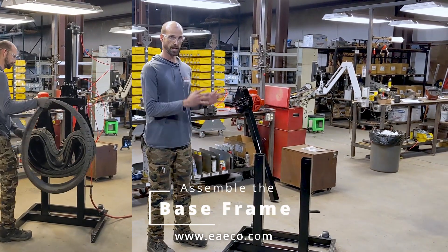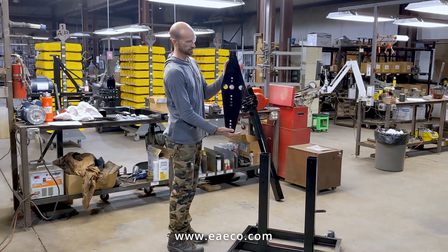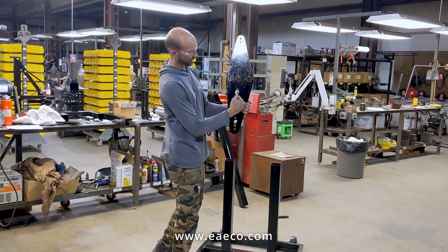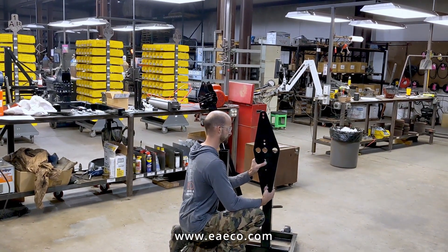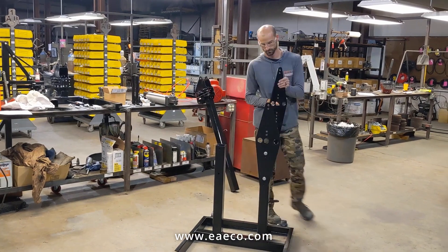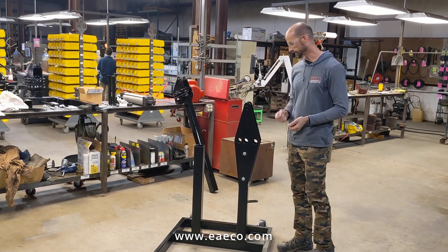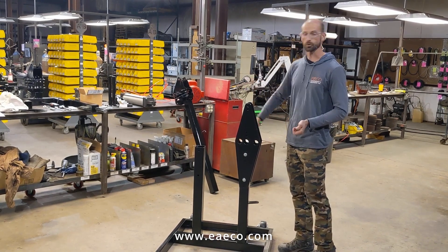The first thing we're going to do, once we've got this off the pallet and out of the box, we're going to grab the plates that look like this. These three holes — these two are a little bit closer together than the third one — and I typically like to start where we've got one hole above and all the other holes below. We're going to match the orientation and line up the holes, then take a washer and a supplied nut on this side. Don't fully tighten them yet; we're going to get more of the machine assembled before we fully tighten all the bolts.